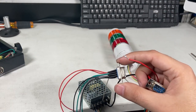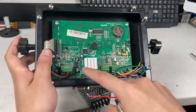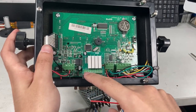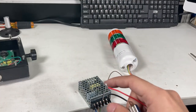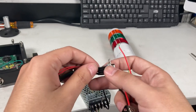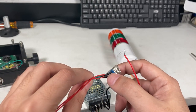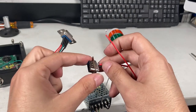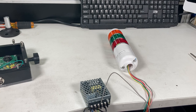And then that's why you specifically need the relay board, because this actually has a switch to short these two pins, these two pins, these two pins. And that's how you were able to actually get a contact, the two switches, and then light up the tower. So that's actually what we're going to do. So we're going to start actually wiring this up. So you kind of see a long process.